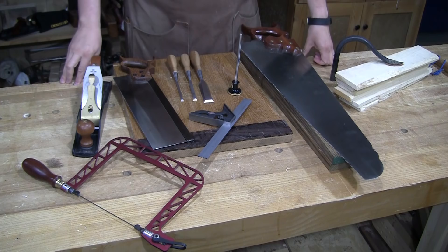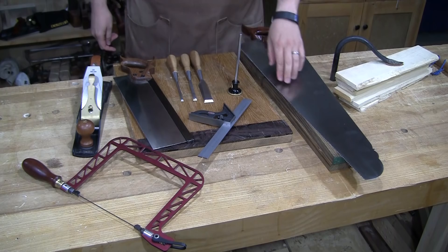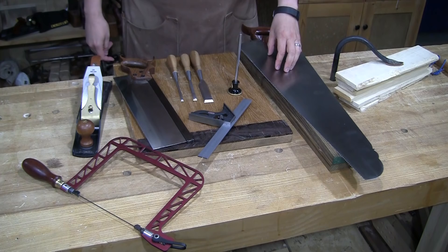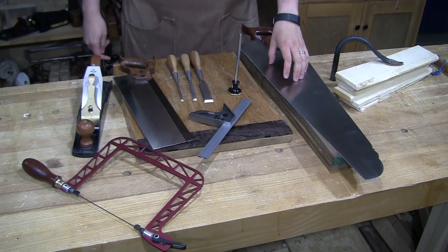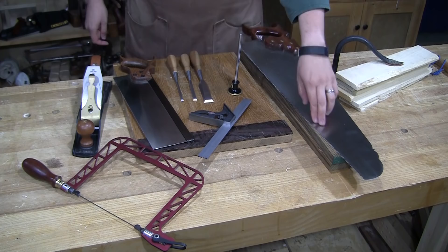So this is it — this is all of it. You want a hand saw, and by definition a hand saw is a full-sized backless saw. I'm not talking about 20-inch long panel saws with a finer tooth arrangement. You can get it in either rip or cross cut. If you're only going to have one, a five points per inch rip-filed saw is going to take you further — you can rip and cross cut with this. Vice versa, you can rip and cross cut with a cross-cut filed saw. So don't worry about tooth geometry yet. Just get yourself a nice long coarse-pitched saw: five points per inch rip, or eight points per inch cross cut.